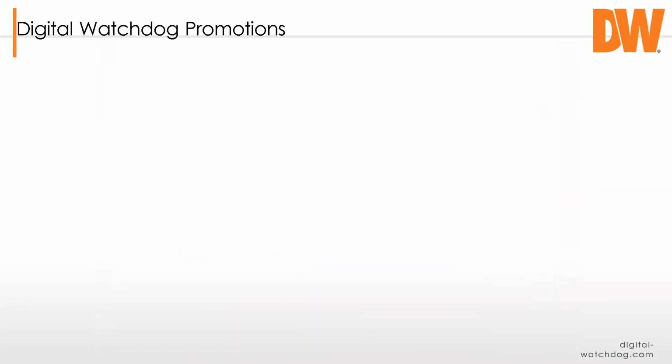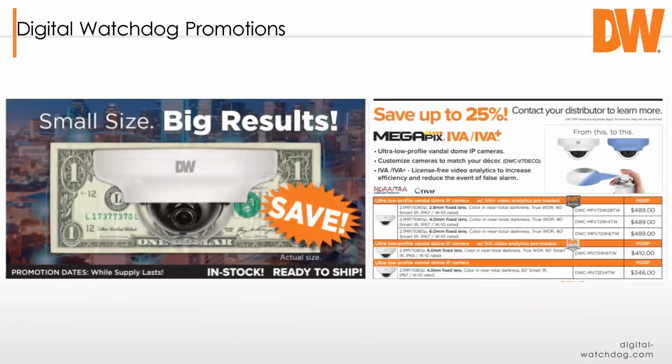And then going back to the video analytics, Spectrum in the CX, which is our Linux version of Spectrum, supports video analytics, and we've got some video analytic cameras on special. These are real small. There's some 2.8, 4mm, 6mm lens with IVA Plus, which has logical rules and a bunch of other features. And then the standard analytics are in a 6 and 4mm lens in a very small size, and you can order these covers. You can snap them on or paint them and then snap them on so they blend in better with the background. I don't know why they chose baby blue. Who paints their walls baby blue? But anyway, it allows you to blend in a little better.